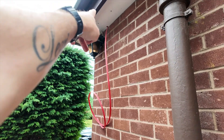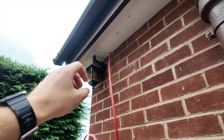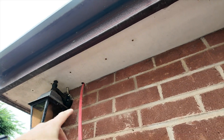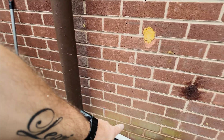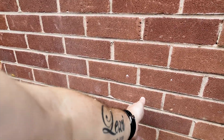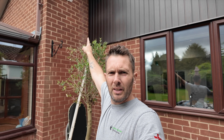We've now drilled the hole for the armored cable and just run the cable tongue up — I find that works because it naturally bends that way. Lou's been in the loft and knows where it is. The plan is it's going to come down here all the way along, and then go inside the unit around about here. Originally when I first came to quote, from the photos I thought we'd pop it up there.